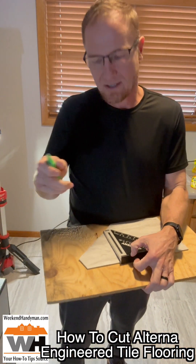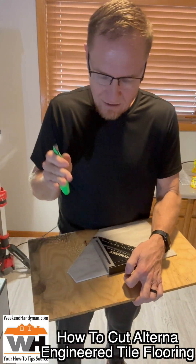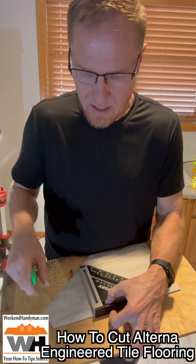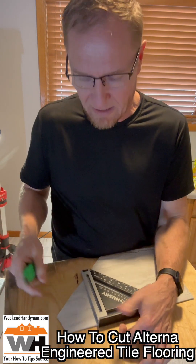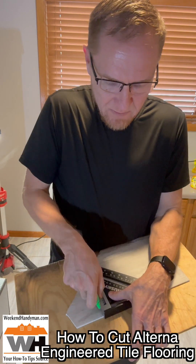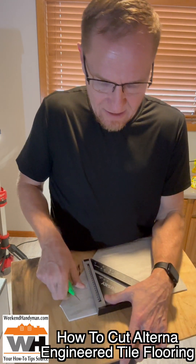You watch them do this online and then you go, and then they bang — yeah, okay, whatever. I found I could be the most accurate when I treated this as the cut of about 20 cuts. What I mean by that is you set your straight edge on there and then go lightly — just lightly score it.